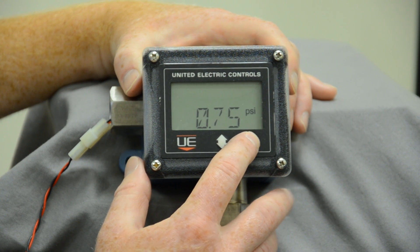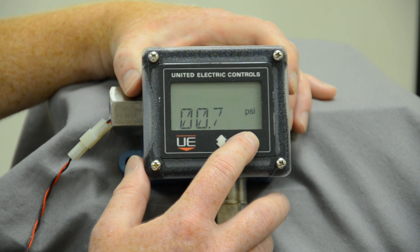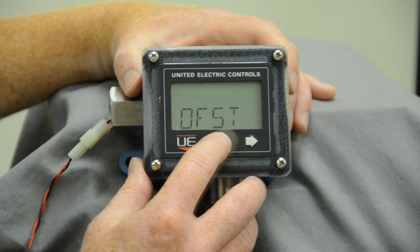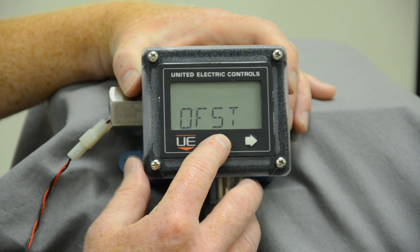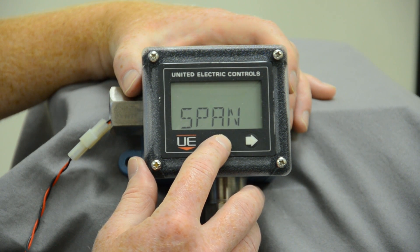In this case we already have a value of 0.75 in here, which means we basically just want it to go on when it's below or above 0.75. Now we have an offset you can do if you'd like, and you have percent of span to adjust your span.